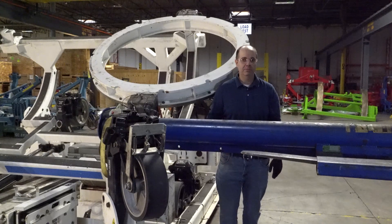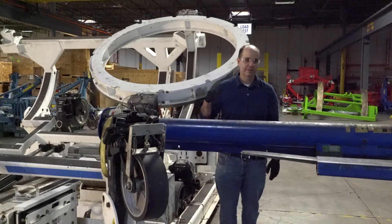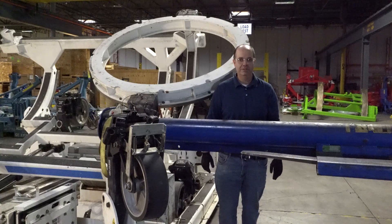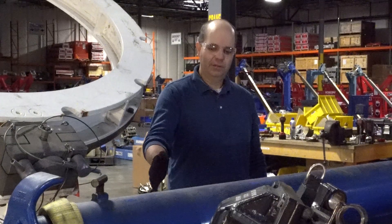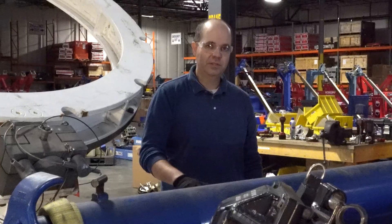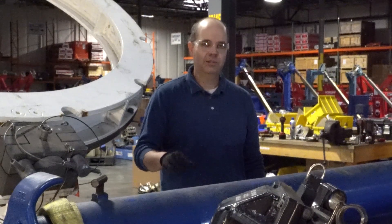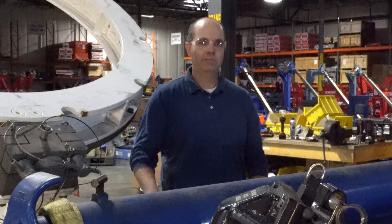You shouldn't have to use a forklift or some mechanical system to force it into position. If it doesn't slide into position relatively easily, check and make sure that nothing is damaged or in need of repair. Throughout this process, I'm going to have the forklift driver lift the shock mount and rotate it down into position. It won't be exactly in position, but I just want to get it roughly positioned so that we can disconnect the straps, and then from there we can maneuver it by hand.